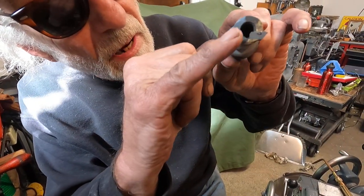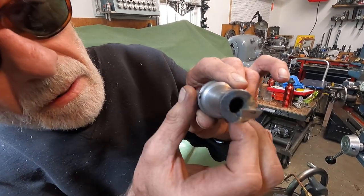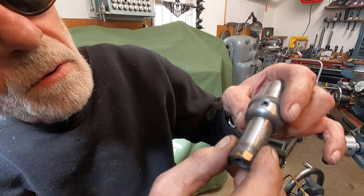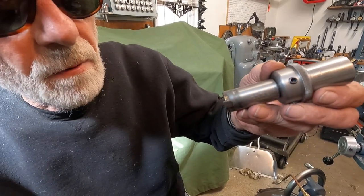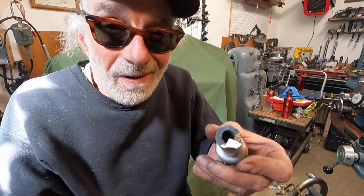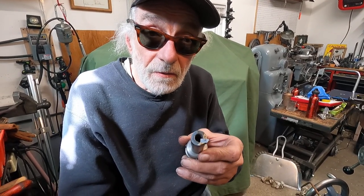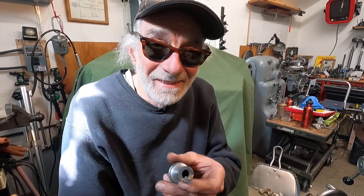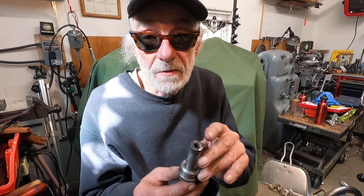That's another one. I put the carbide blank in there below center, and when it rotates up to center, it's got some rake on the top. And you can also put a groove in so you can get your two angles of top rake. When you're making your own tools, you are the one in control. And that's pretty handy if you're machining some very difficult materials, like aerospace materials or some of the stuff they have out at Hanford — high nickel stuff, all kinds of things like that. You might want to vary those angles to get a good finish.